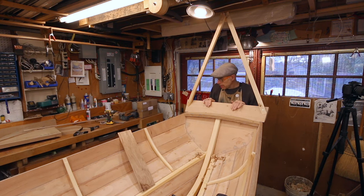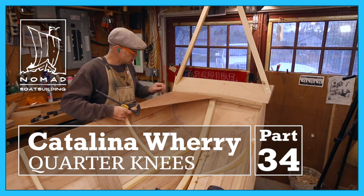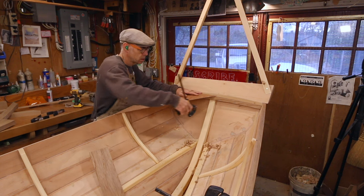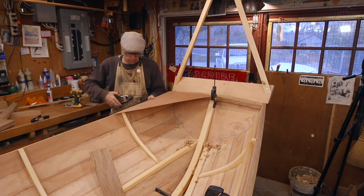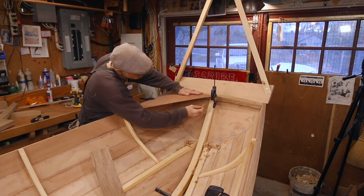With that done, I can move on to actually fitting these quarter knees. We're going to build the knees as laminated knees with a solid wood block for the inside corner. We're doing that because it doesn't make sense to run laminations all the way to the inside corner — it's a lot of extra material and work to fill in that corner. It's simpler to create a nice sweeping lamination of reasonable thickness and fill in the blank with some solid stock.